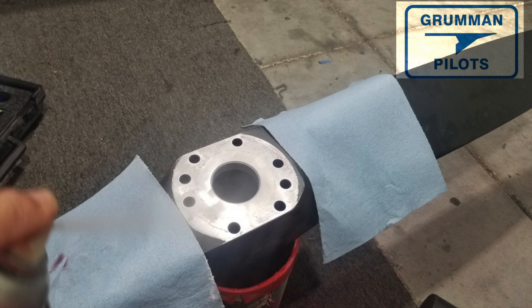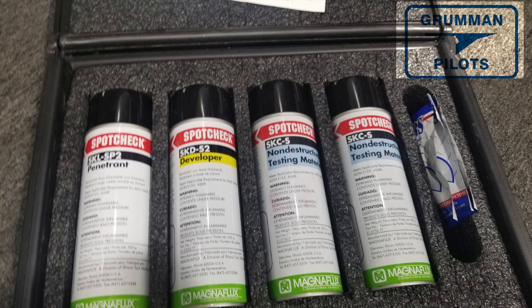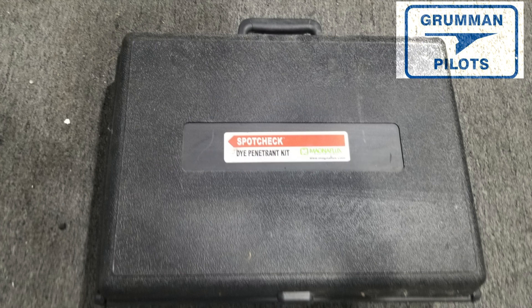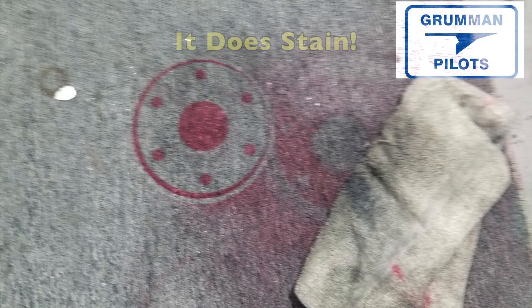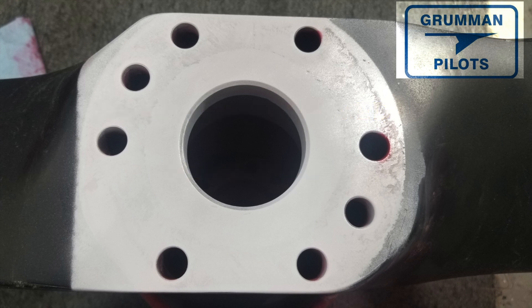Take a good hard look at both faces to determine whether you have a crack in the hub. If you don't, no problem. These entire kits are available from Aircraft Spruce — the four-can chemical spray kit is about $89.95 plus shipping, by Spot Check. It's a non-destructive test kit called the dye penetrant test. One caution: it stains a lot, even falling on scrap carpeting, so wear gloves and work in an open area. When you're all done, make a logbook entry.